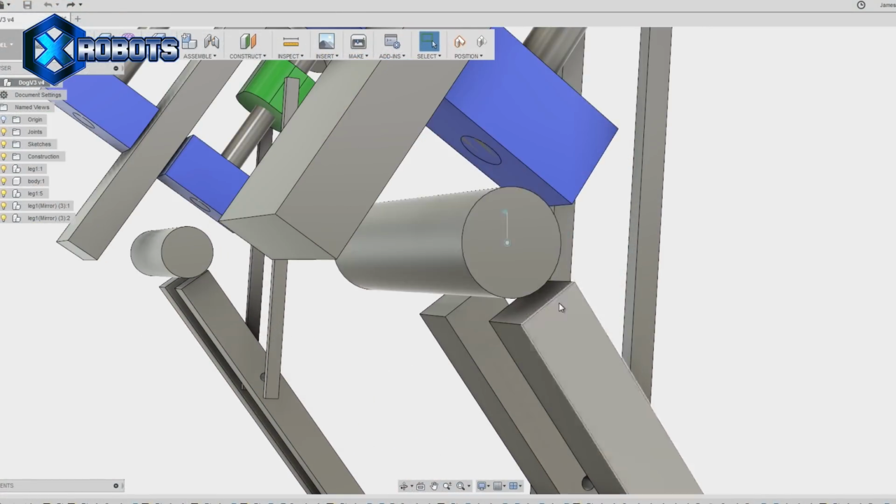So we're going to look at where those joints are floating in the air, make some 3D printed prototype parts, decide if those are strong enough or they need to be made in metal, hopefully at least get one leg joint moving with the O-drive, seeing how agile it is, calibrating the encoder revolutions for the ball screw length and checking all that trigonometry works in real life.